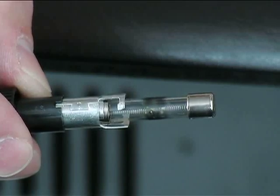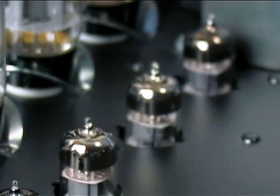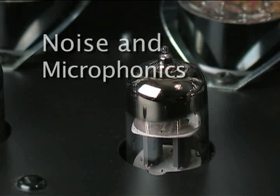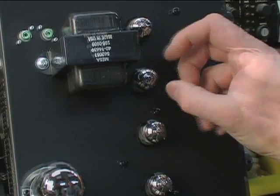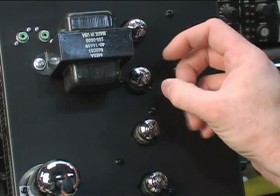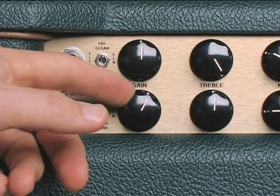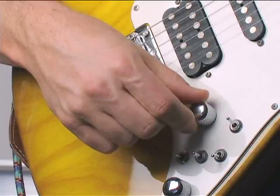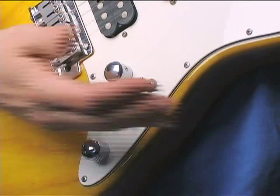Now that we have covered how to remedy a blown fuse, here are some tips for issues occurring in the preamp. Preamp tube problems can take many forms but can generally be described in two categories: noise and microphonics. Noise can be in the form of crackling, sputtering, white noise or hiss, and/or hum. Microphonic problems usually appear as a ringing or high-pitched squealing. This characteristic gets worse as the gain or volume are increased and is more noticeable in higher gain modes. Microphonic problems are easily identified because the problem is still present even with the instrument's volume off or unplugged, unlike pickup feedback, which ceases as the instrument is turned down.